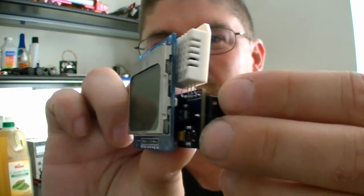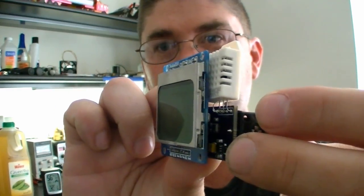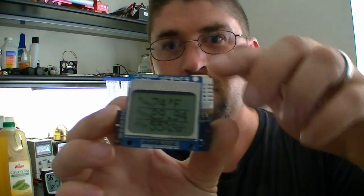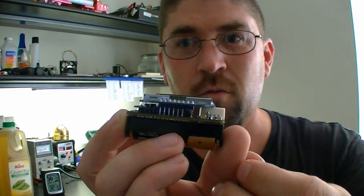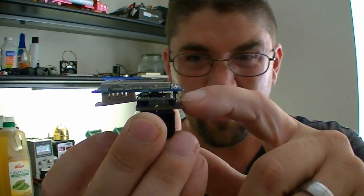For a slightly closer look — since I can't exactly take the screen off, it's soldered directly on there — on this side you can see the little silver BMP180 at the top. The bottom half of the components are the NCP1402 boost regulator that takes the power from a single AA battery from 1.5V up to 3.3V, and it'll actually run down to 0.3V before it finally dies out. On the back, you can see the humidity sensor four pins connected in. On the bottom, you can see the Nokia 5110 LCD soldered in, and right below it, on the side, you can see the Pro Mini put right in there.